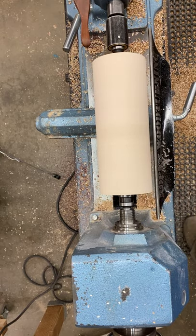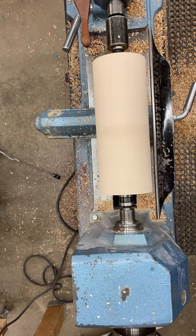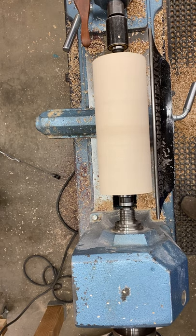What do you notice that's different? Right. So, we teach you guys when we start right hand back, left hand pinch. This is how you have the most control of the gouge as we're making this cut. It's not very much of a finesse position though. It's more of an aggressive, we're going to hold on to the gouge and not have it come out of our hand.